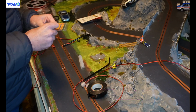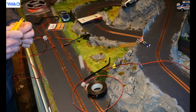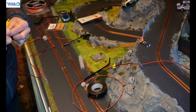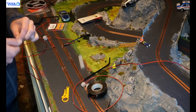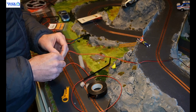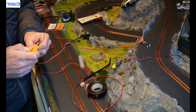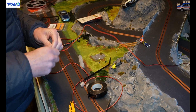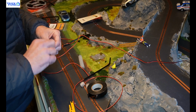As you can see, when I cut the wire, the power went off. I've turned the power off now. I should have done that before I cut the wires really, but hey-oh, is what it is. So now just trim back this main wire. So there are lots of different ways that you can achieve the same outcome. Some people do push clips. I prefer screw clips, just old school like that. So I'll just get these.